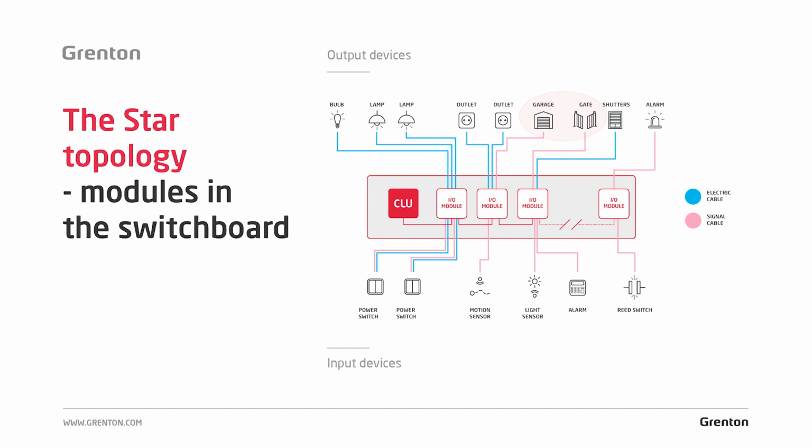We just recognize a short circuit, so in this case there is no need to lead a purely thick electric cable. Just a low voltage cable is enough. It is good practice to use a twisted pair cable in this case, which has more pairs and in the future will allow to use free pairs for other receivers that we will want to control.